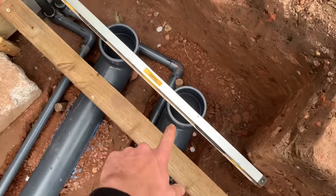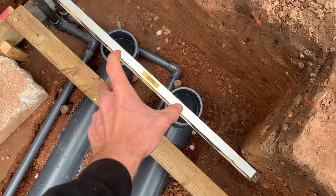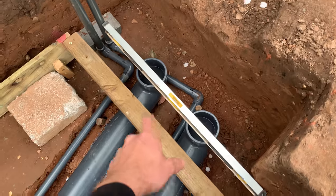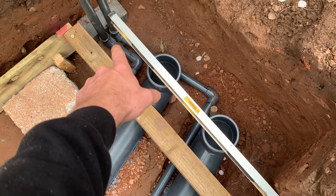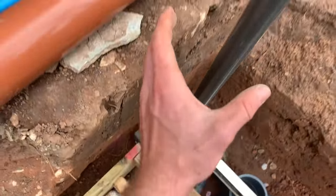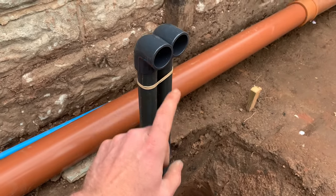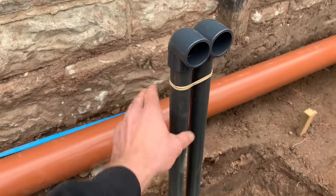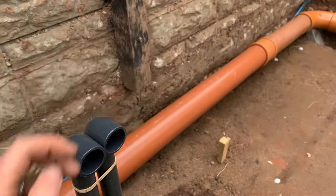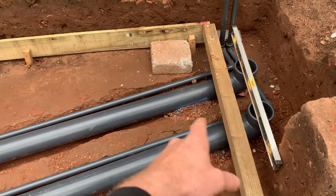I've also made sure these two pipes are the exact distance apart — they need to come up 300 mil out of the ground so they can go directly into my drum filter when I get it. I've made sure they're dead level, both down here which will be the back of the pond wall. These two will be pinned directly against the filter house wall — one will be higher — and then both lines will run across the filter house wall. Pretty much now everything's glued up and everything's in place.